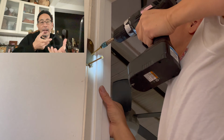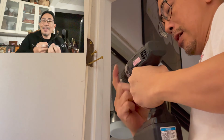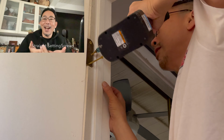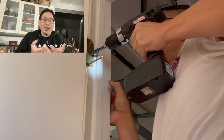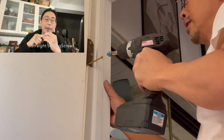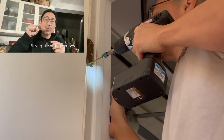I used my electric screwdriver to remove the old screws, and I found that one of the screws was actually broken inside of the hole and I couldn't get that screw out, so I had to put glue on the chopstick that I split open and push it into the hole and get my new screw to go straight into the hole.